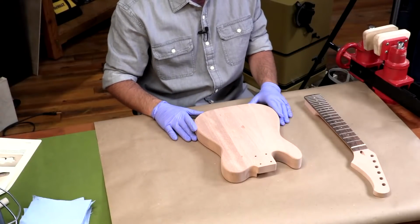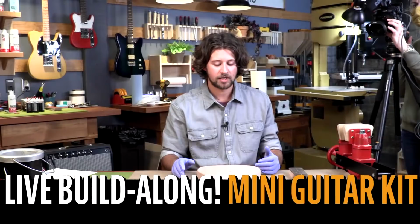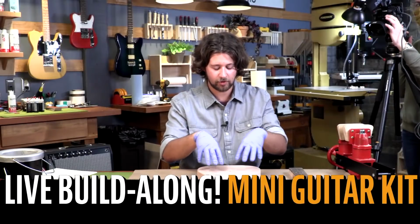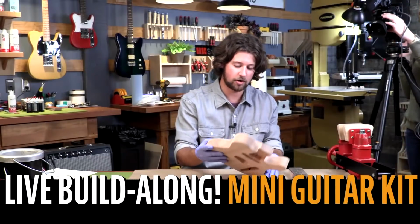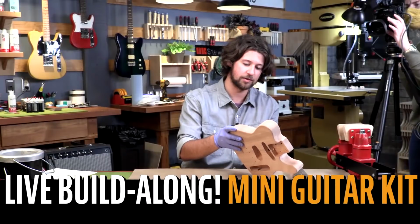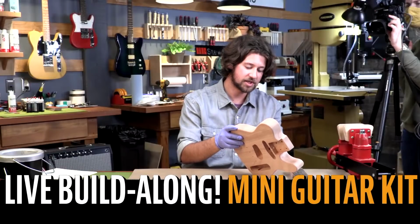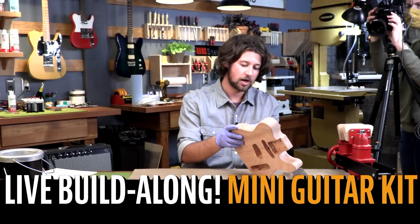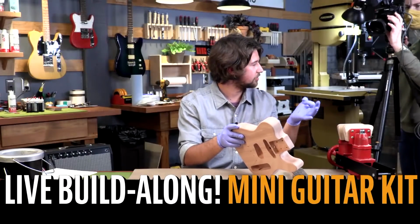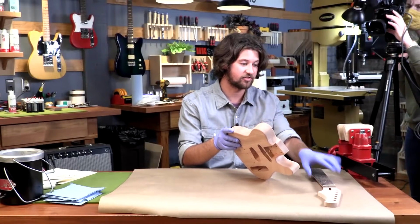I think it's important to say too that you don't have to use grain filler if you don't want to. The reason we're using grain filler is to fill up the grain so it's level with the rest of the wood on the back. Basically, these grains are just little tiny holes in the wood. This is mahogany, so it's very porous. If we don't fill all these little tiny holes and we go ahead and start putting lacquer on it, you're going to see little tiny holes in your lacquer. We can avoid that and have a nice flat finish if we put grain filler on this.